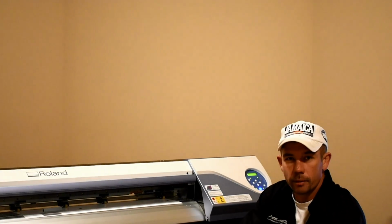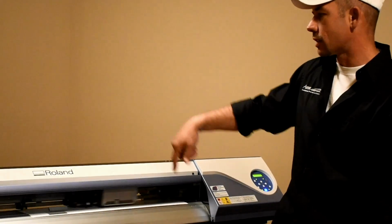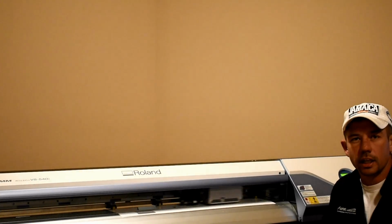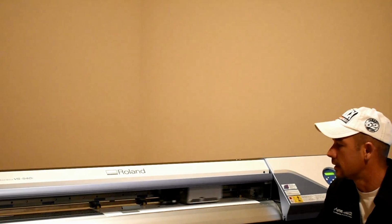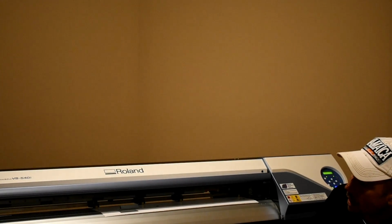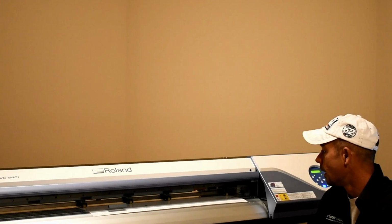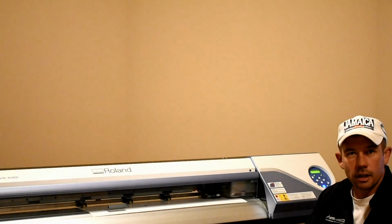This printer, I'm very impressed with it. Just so you guys know, this is the 8-color VS-540i. And we've actually got it set up in a 7-color system to where the 8th color is a cleaning cartridge where it runs solvent through the tank, and that just helps keep your heads from drying up and things like that. We're running light cyan, light magenta, yellow, black, and then light black is the different ink colors that we've got, plus the solvent cartridge. And I guess we'll go ahead and cue the time lapse.